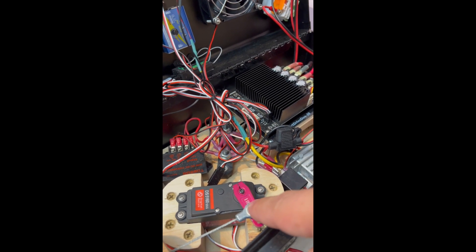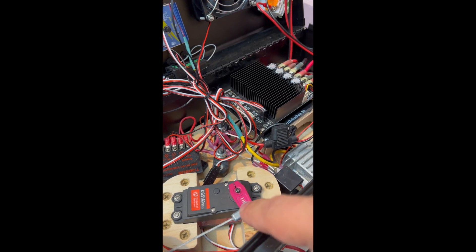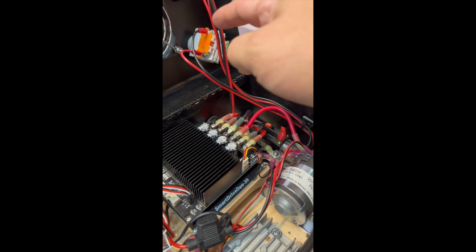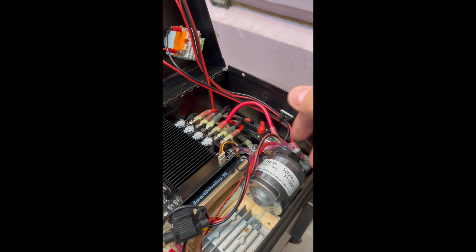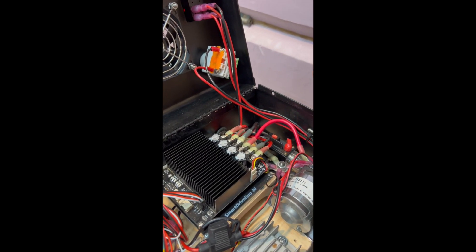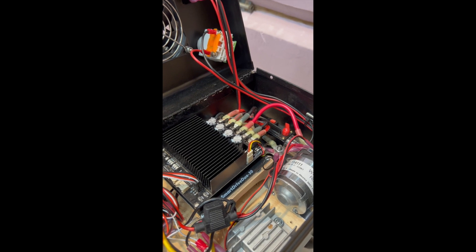Reset the servo back to its zero position and engage the blade brake. A lot of this is to accommodate that this piece here is a bigger, more massive solenoid. It allows me to have a very small current run through this, and when it senses the big current — potentially up to 80 amps — it runs through here. That way I don't have to have my fingers near it, and I don't need a monster switch.